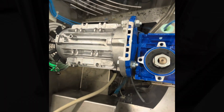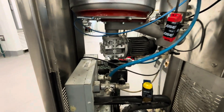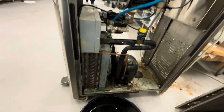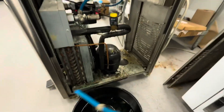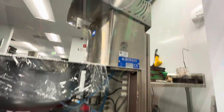This machine is a glycol machine, so this device here is the chiller. This line was the one that's broken, so I pulled that off — it goes down to here. I've got a new section of tubing, so I'm going to replace that and then refill the glycol.